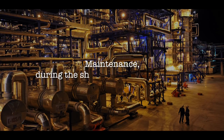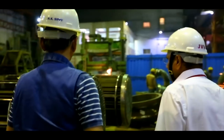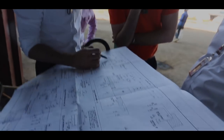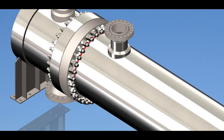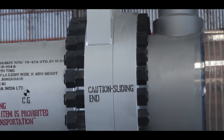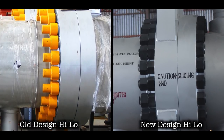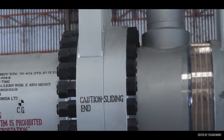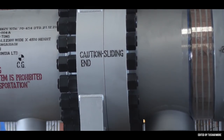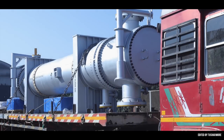Maintenance during shutdown is also a big concern. In the process of manufacturing high-low construction, we decided to re-engineer the design of the shell to tube sheet gasket and joint to make it leak-proof and easily serviceable, thereby eliminating the leakage hazard. This has been achieved by avoiding the tap threaded blind holes in which bolts get jammed easily and cannot be removed. The bolts have therefore been changed to studs and nuts to provide the option of replacement. The flanges have been redesigned to accommodate studs and nuts in place of bolts. This is quicker and cheaper to maintain in service with a nominal increase in cost.